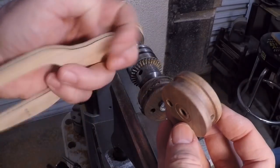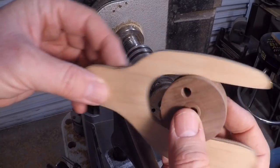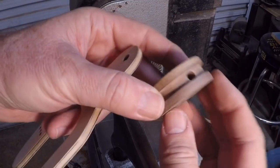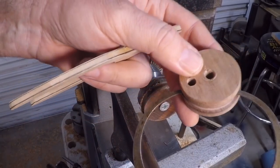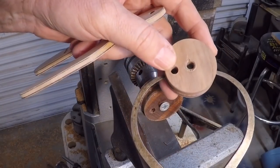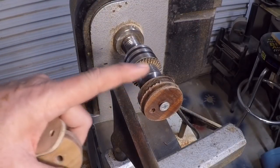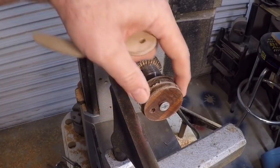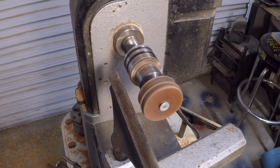My prototype cam has a groove in it, and this cam rider fits into it nicely so it can turn and move the cam rider without interference. I've turned this on the lathe and taken it down to the dimension I want. To copy this, I'll use my calipers to capture that dimension. I've got my blanks and I'll chuck them up one at a time using this quarter-inch screw with a nut and washer on the back as my arbor. I'll turn each one and clean up the outside diameter, then create the groove.